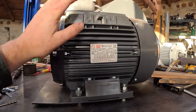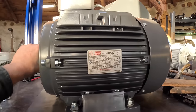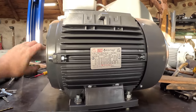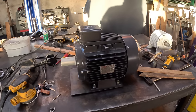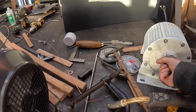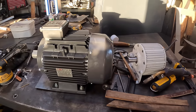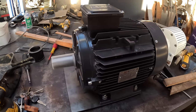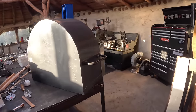It's a motor, not a generator, but when we spin it at a certain speed and add capacitors it becomes a generator. You're probably looking at it thinking it's big — and it is, in comparison. The mountings on the feet are all different, everything's different, and it doesn't fit inside the guard.